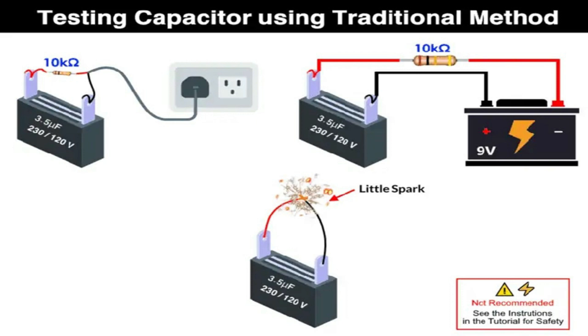You would have to change a defective capacitor immediately with a new one. Note: a polar capacitor should not be connected to an AC supply. A non-polar capacitor can be attached to a DC supply because they are back-to-back electrolytic capacitors. Capacitors block DC but pass AC, though they will still charge with a DC supply until reaching the terminal voltage. In short, non-polar capacitors can operate on both AC and DC supplies, while polar capacitors only operate on DC.